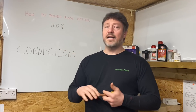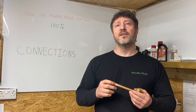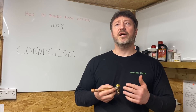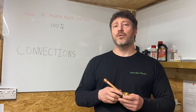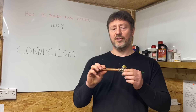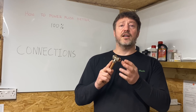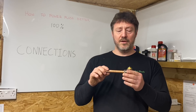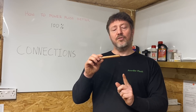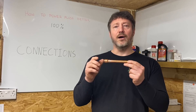If you have to connect into a radiator, be aware that on some hot water circuits or one-pipe systems you may not be cleaning the system at all. If you do connect into a radiator, don't connect through the TRV or lockshield valves — the valve acts like a strainer and debris will stay on the other side and won't reach your machine. I recommend taking the valve out and connecting straight onto the 15mm pipe below the valve, giving you a full-bore 15mm connection for maximum flow and the ability to get the biggest debris out.